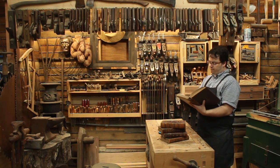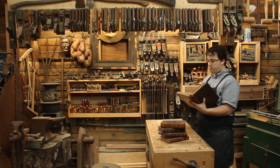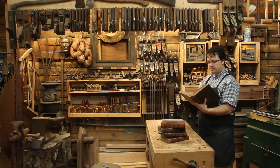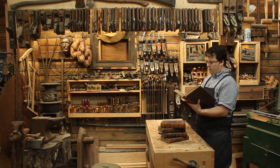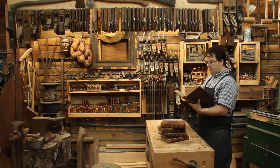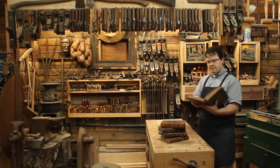The workbench is the first and most necessary of all woodworking tools. Seems Roubo agrees with me. It's made up of a top, 4 legs, 4 rails, and the bottom. The top is made from a sturdy plank or table about 5 inches to 6 inches thick by 20 inches to 25 inches wide. Its length varies from 6 feet to 12 feet, but the most common length is 9 feet.